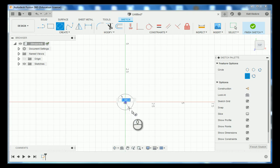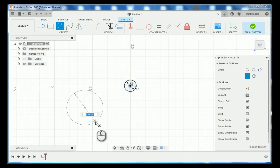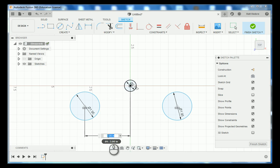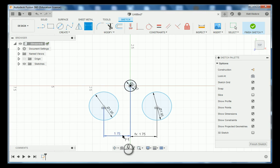Then I'm going to put a circle down here at 1 inch 950 thousandths, and then another circle over here at the same diameter. I'm going to add some constraints so these two circles' center locations are horizontal to each other. Then I'm going to add my dimensions in — this circle from the origin is 1 inch 750 thousandths wide, the same on the other side. I'll click on the original measurement and put a variable in. The vertical location from our center is 582 thousandths.